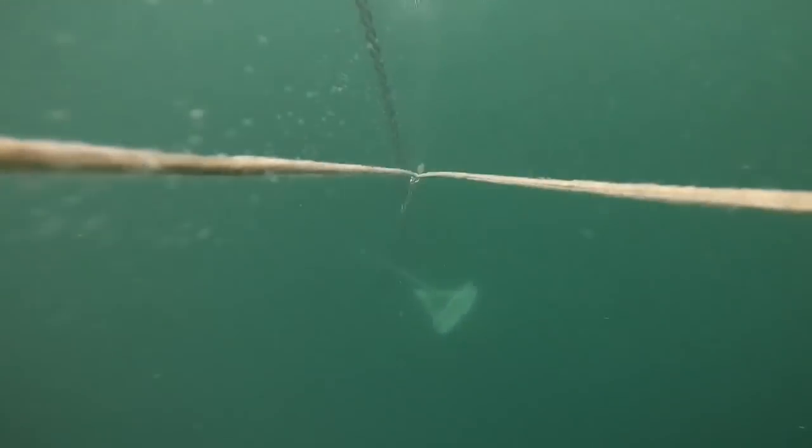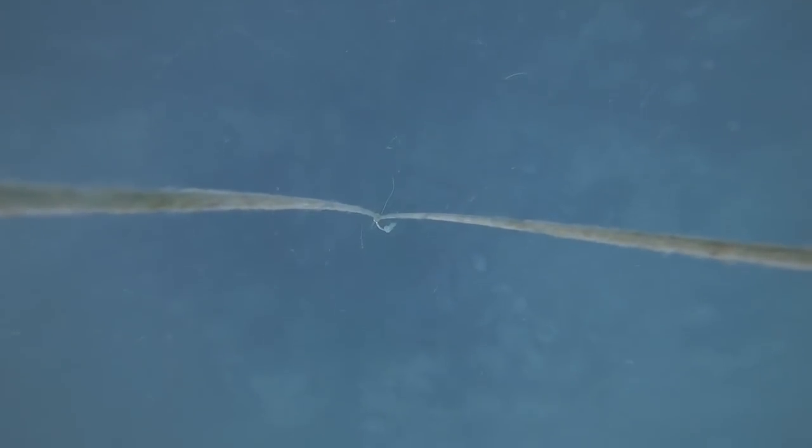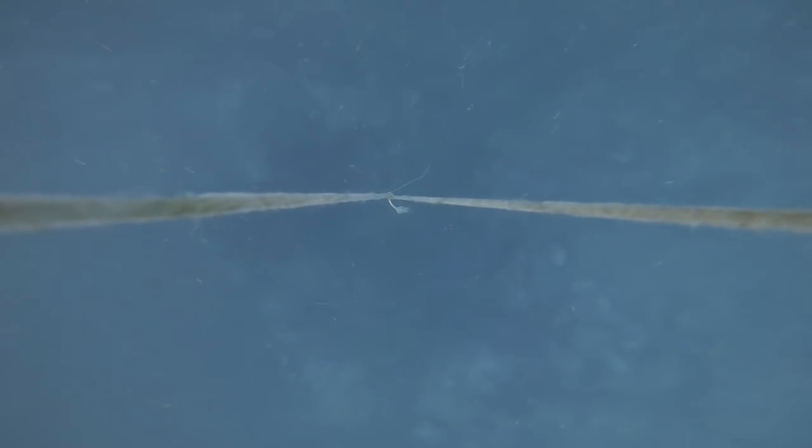Okay, we're now back at Scow Bay with the soft mud seabed. Pictures are quite a bit clearer than we saw with my big soft mud shootout from a couple weeks ago. In that shootout, this anchor held 500 pounds pretty solid, but then drug at the higher power setting. But now here in the modified condition, we're going to see that this anchor is brilliant. The pictures are good enough for us to see just how far this anchor moves, and in total, it's not far.